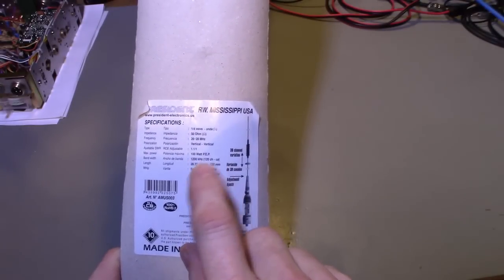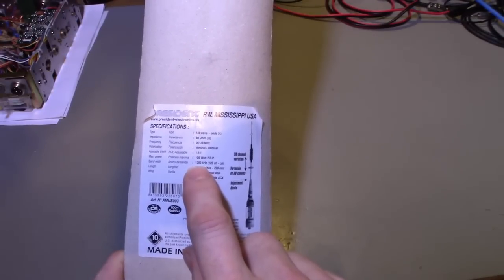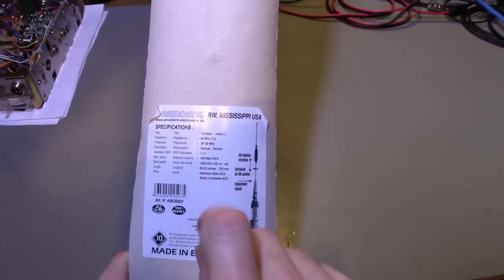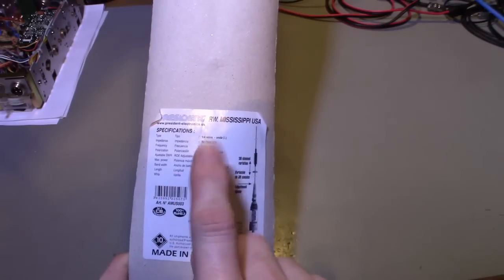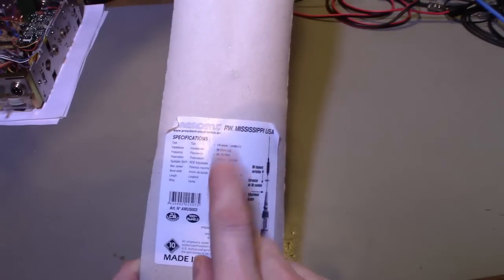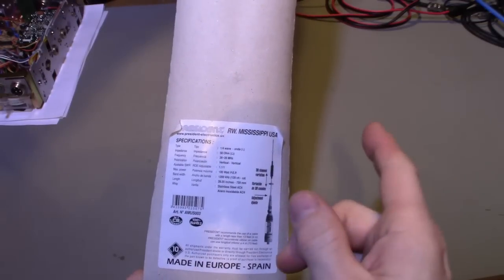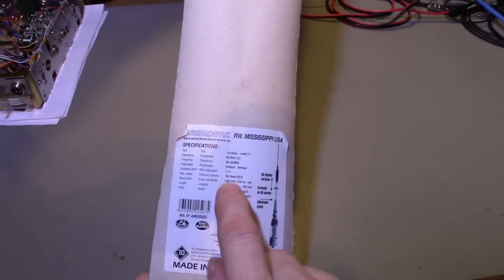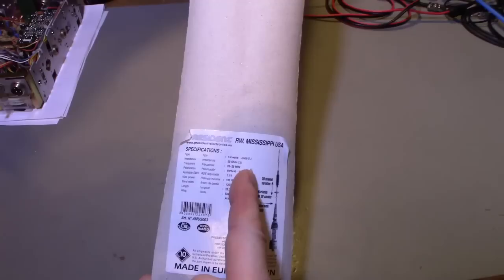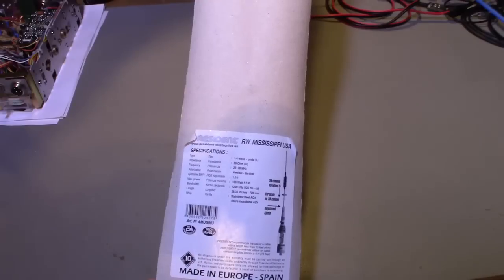What do we have? 100 watts peak, bandwidth 1,200 kilohertz, or 1.2 megahertz, which would be 120 channels. So that's pretty good. And we'll see what it does on CB channels, from channel 1 to 40. The car I'm going to put this on, I have a President McKinley in, so we can take a look at the SWRs because that has the automatic SWR function, which is really nice. If we tune this antenna on channel 19 or 20, we'll see if the SWRs stay pretty flat, at least from channel 1 to 40.